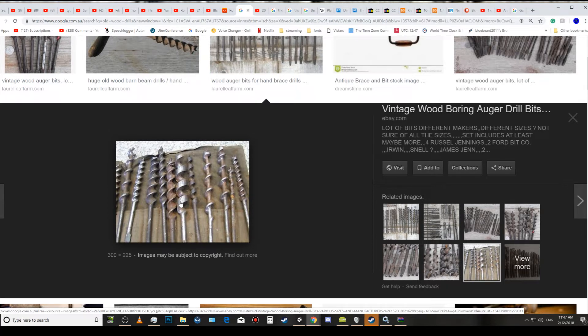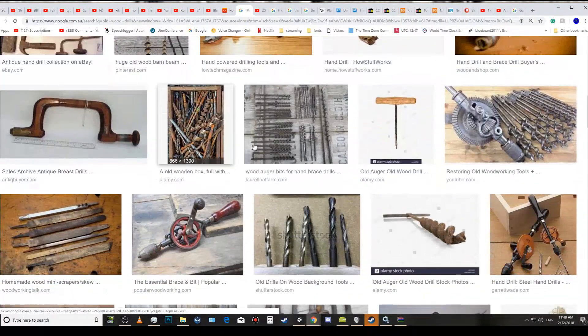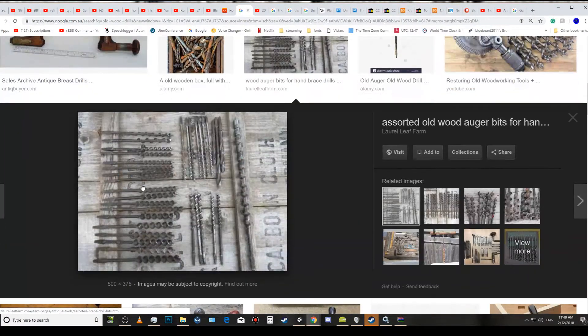The crunching in his video was the pellets breaking on the metal, chipping off metal. Trust me, plastic can break metal — it happens all the time in the plastics industry. To overcome that, you use a different type of screw — screws more like these, not like that one. Avoid the modern metal-style drill bits altogether.